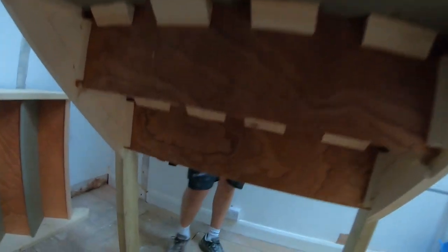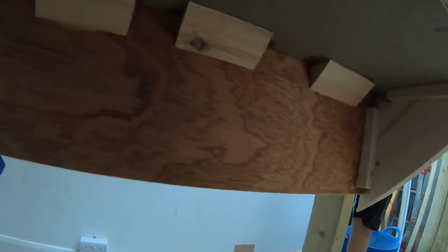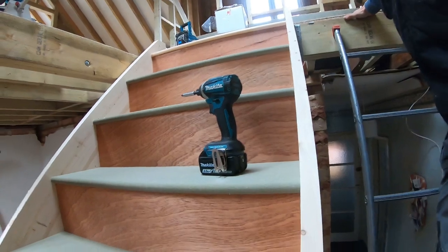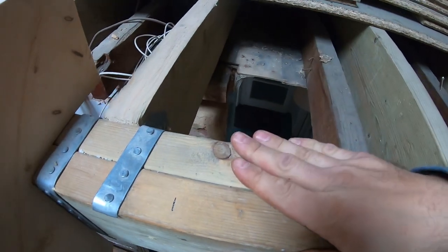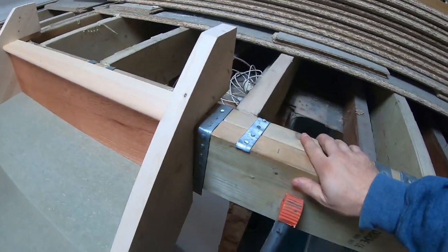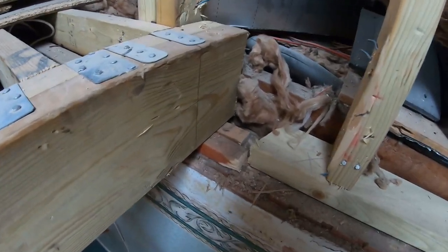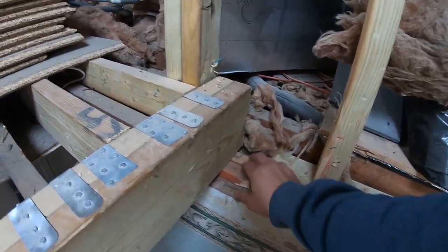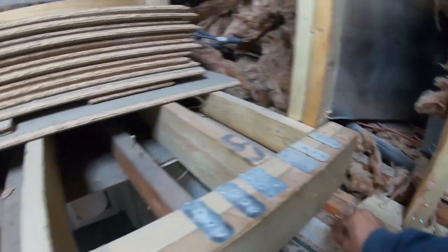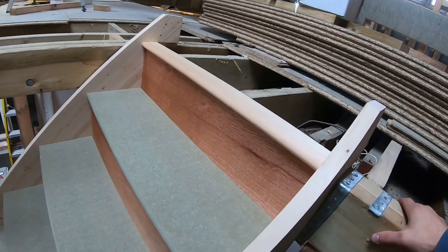So what we'll do here, we will build a wall here, so that the flight of stairs sits on it. So let's show. When you fit stairs, you need double timber, and it's called trimmer. So that's what you need to have. Obviously don't pack it with the batten, we're going to change that for a 4x2 packer cut on a saw. We'll put it on a bit later. So that's what you need to have to take stairs.